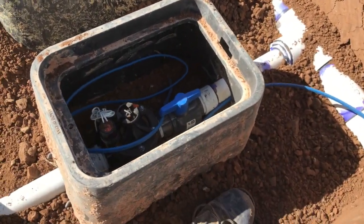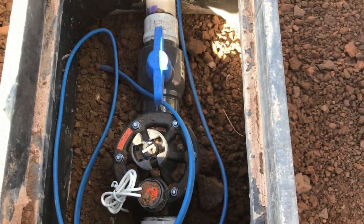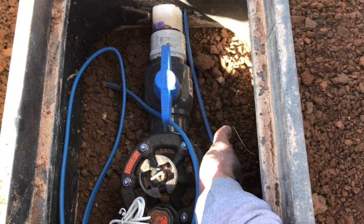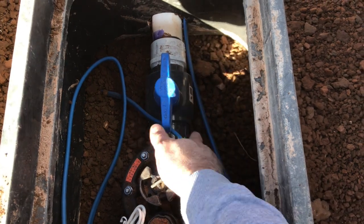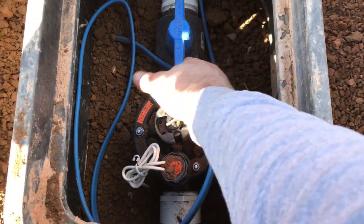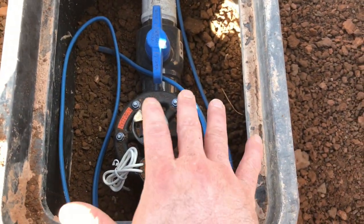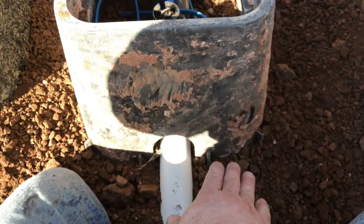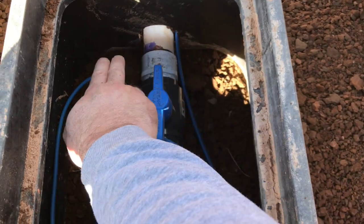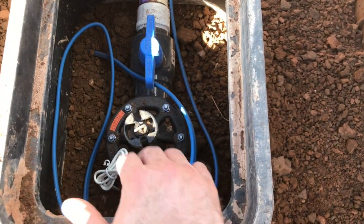Let me get in here and show you — all the way around this, I can reach all the way to the bottom. I've got my ball valve, my shutoff valve here, but when I come in to have to work on this valve, I've got no dirt around it. There's no dirt around the wires and the solenoid, no dirt around any of this. When you use two valve boxes, I can get it all the way down to where it covers the bottom of the pipe and the bottom of the valve. It makes it a whole lot easier to come in and work on this later.